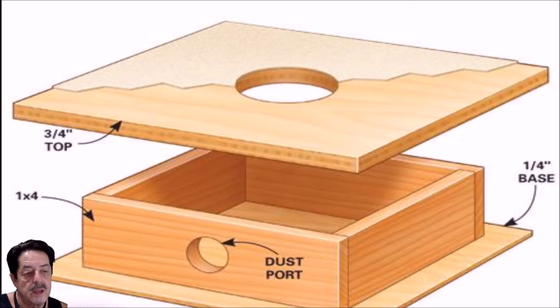I can sand curves and all kinds of things. I can change the grit on those sanding drums — they're inexpensive to buy on eBay, Amazon, anything like that. They come in a set of usually six or eight, depending on what you want, in varying diameters. You just use regular sandpaper, cut the sheets, and the instructions show you how to tuck it into a groove. Then put it on your drill press, tighten it up, flip the switch on, and it's real handy, especially on curved pieces.